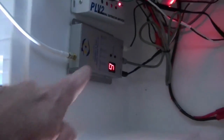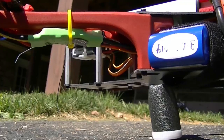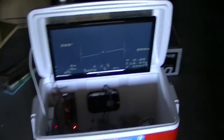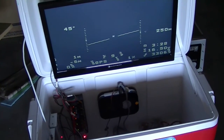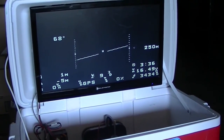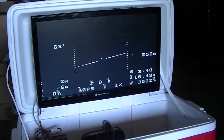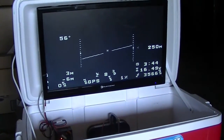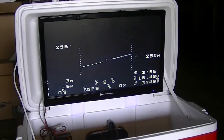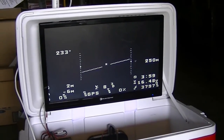The ground station is set to 1280 and now I'm going to plug in the transmitter. Okay, still have a solid lock, the light is blinking green. Plugging in the transmitter now - transmitter is plugged in on 1280 and I'm seeing a green and three reds. But inside we can see it's not so bad - I actually got nine satellites. Eight and nine satellites now with the lower wattage transmitter, so I think that's the problem.